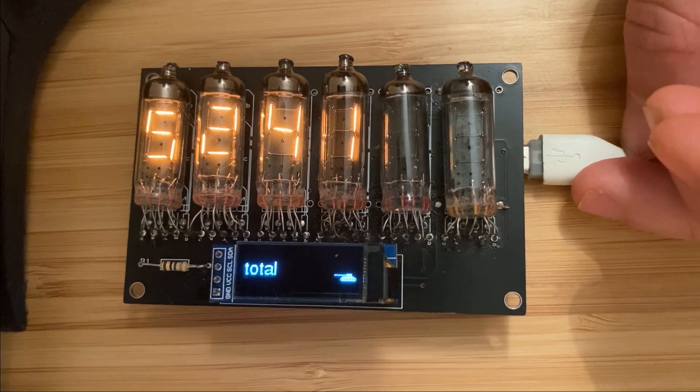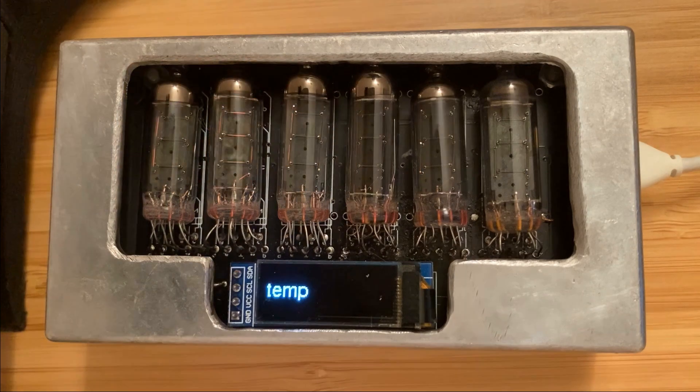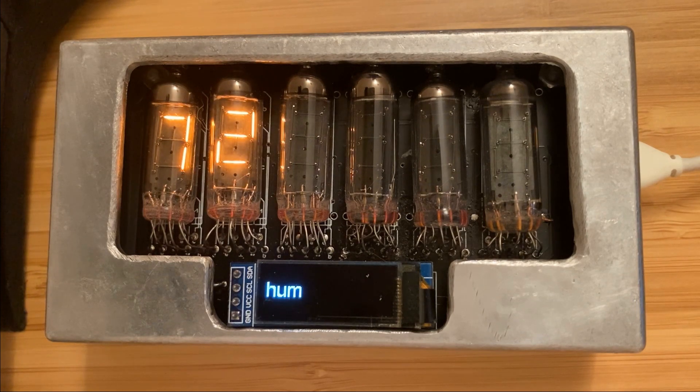When I'm using vintage electronics I tend to try and run them under spec to prolong the lifetime, and these are no exception. These are designed to run at 4.5 to 5 volts according to the Russian datasheet, but I'm running them at 3.3 volts. Assuming they're similar to the RCA Numitrons, which they basically copied, the design life is about 100,000 hours at 5 volts. Filament lifetime is actually proportional to empirically somewhere between the 12th and the 16th power of applied voltage — you heard that correctly. So just taking the lower bound gives an on-paper lifetime of hundreds of years. Obviously with them switching on and off I imagine that's theoretical only, but I don't expect these to fail anytime soon.